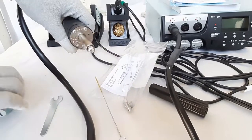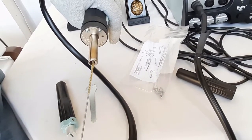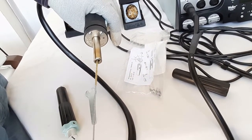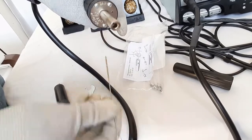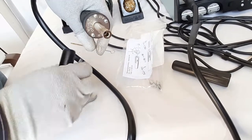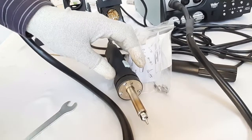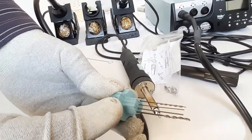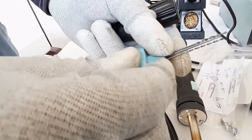Now we will show how to use the long cleaning pin and cleaning tool. The long cleaning pin is used to clean the head of the desoldering iron. Remove the nozzle from the fixture, then insert the long cleaning pin to clean the desoldering head. After cleaning, fix the desoldering nozzle back by twisting clockwise. The cleaning tool has different cleaning pins — remove the aluminium cap and choose the appropriate pin matching the size of the nozzle.